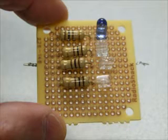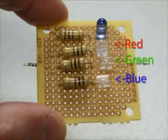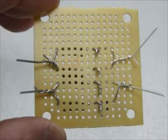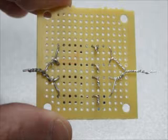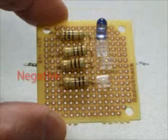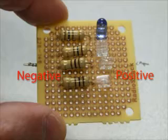Repeat this previous step in succession. After the infrared LED, add the red, green, then blue LEDs. Once the four LED series connections are made, twist the resistor wires together, and then the LED wires together. This creates a parallel circuit amongst all the LEDs, with each of the LEDs having a 100-ohm resistor in series. The resistor side will be the negative terminal of your circuit, and the LED side will be the positive side.